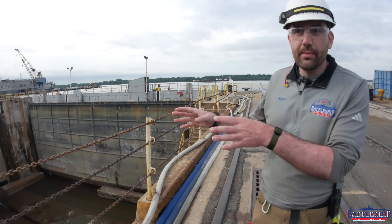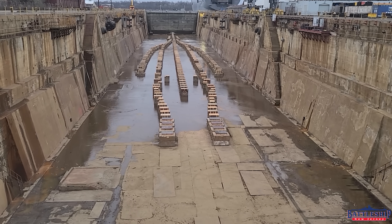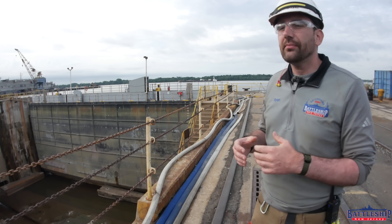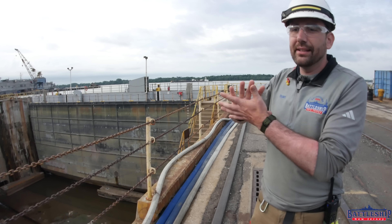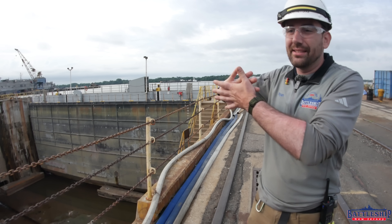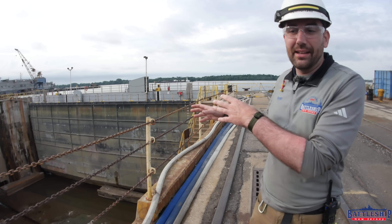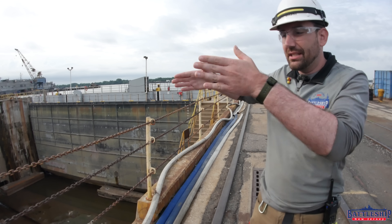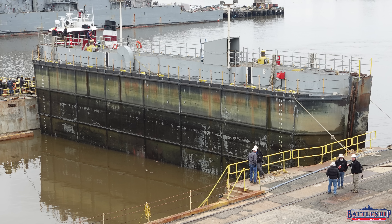So if I wanted to remove the battleship from dry dock, which I do want to do in a couple of weeks, what you would do is flood the dry dock with about 37 million gallons of water that will equalize the level inside with the river behind us. At that point, the pressure of the river is no longer holding the caisson against its gasket. The only thing holding this caisson in place is the water pressure on the outside pressing it against the entrance. So once the caisson is no longer being pushed against the gasket, you can pump it out or dewater it. The caisson is filled with water right now to have it sitting that deep, so you pump it out and it's going to rise up and float, just like any other vessel.